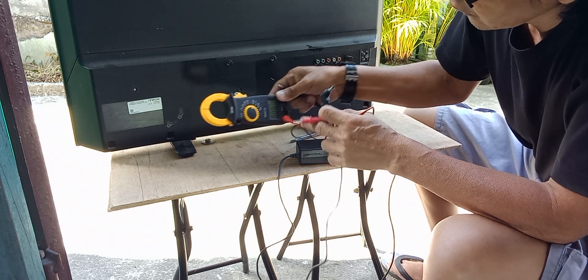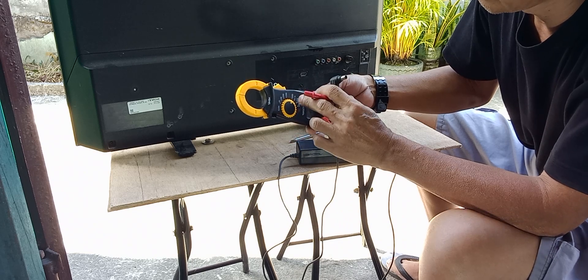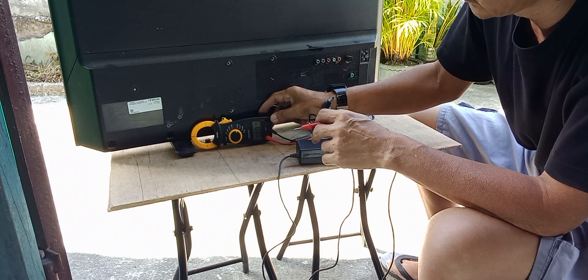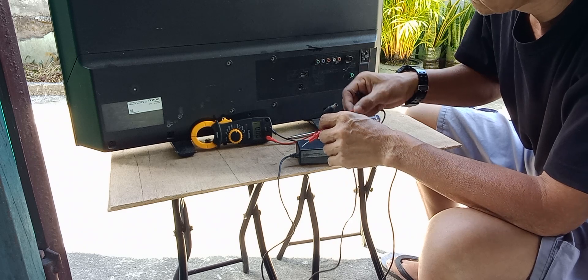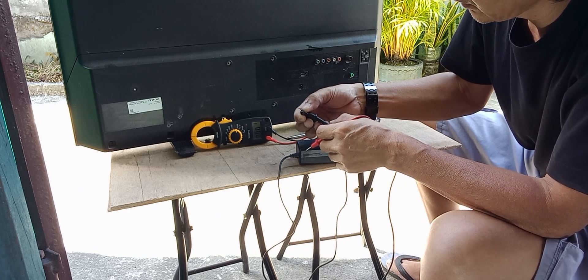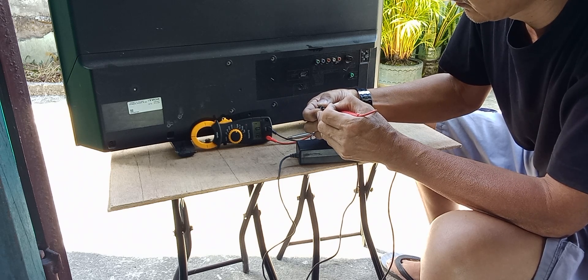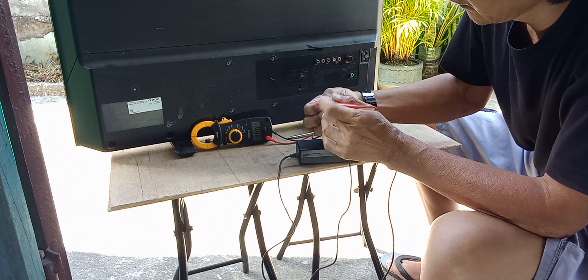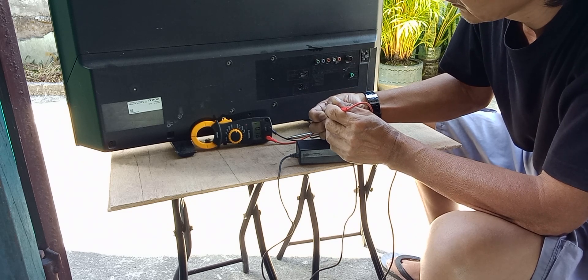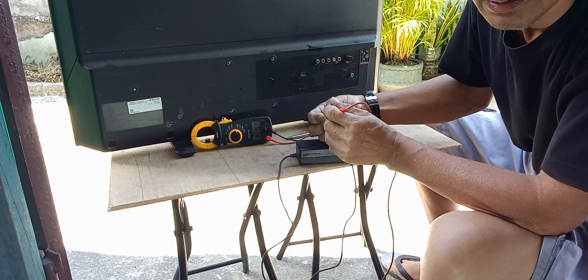The range is 600 volts DC. I'm going to put 600 volts DC on this tester. To check these power supplies, just put the negative in the outer line and the positive in the inner line. Let us see if it's good or not — it reads 19 volts DC output. That means it's good.